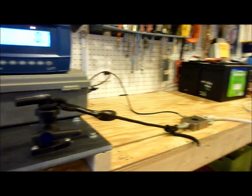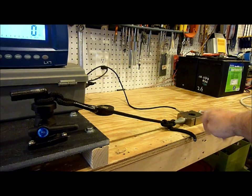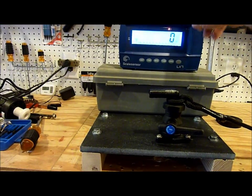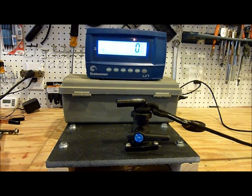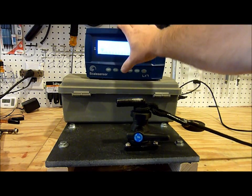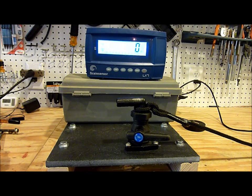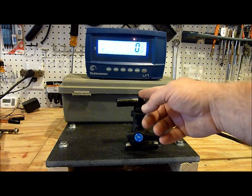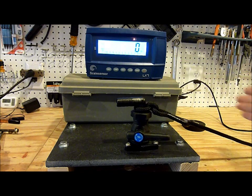As you can see, my winch is down at the other end of the bench. This is the load cell and this is the digital readout here. I am going to put it on peak hold so that if it does fail, we know where it failed. For the ABYC test, you're supposed to be at the innermost hard piping and apply 500 pounds of load, and it needs to withstand it for 30 seconds.